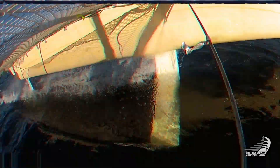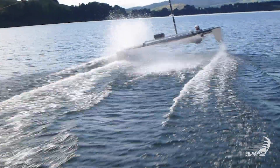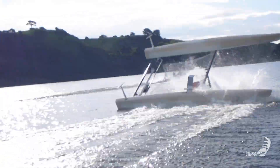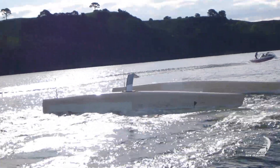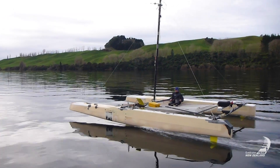Some of the early foils were not very heave stable, pretty loose and out of control. But much better to test that on a small, tiny platform being towed by a power boat than doing it at an AC72 scale. After a couple of weeks of tuning and dialling in, and then some more foils built over the next couple of months, we eventually got to the stage where we could actually tow the boat and it would pop out of the water and fly stably.